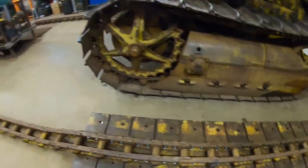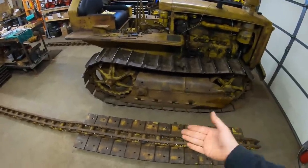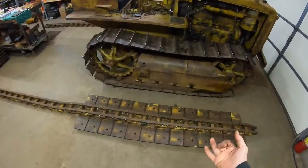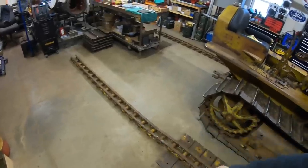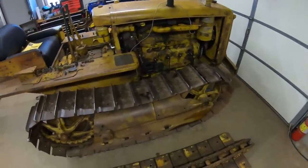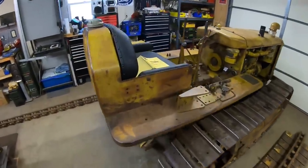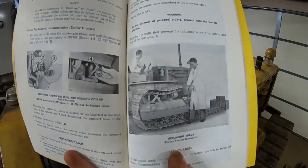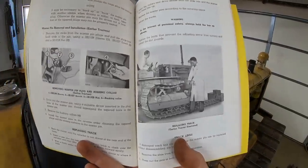The reason we've only got about half of the track pads on each chain is because these 20-inch wide pads get so heavy so fast. What I'm going to do is loop these bare chains off, slide them under the machine, set the machine down on them, then loop the bare chain around, master-pin it, tension it somewhat, and then install the rest of the track pads all the way around. That's the easiest way I can think of to do it by myself — you can see what the book calls for is a guy who just walks the track around as the drive sprocket pulls it. Two reasons I can't do that: one, I don't have an assistant; two, I don't own a white lab coat.